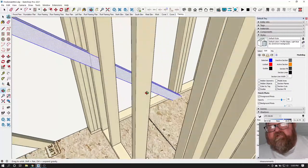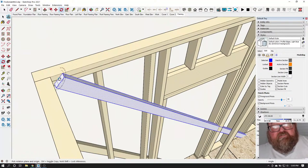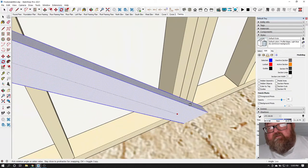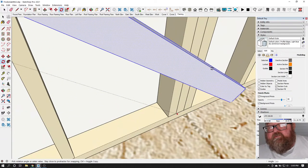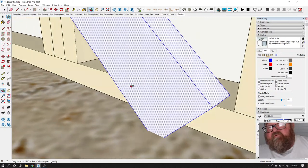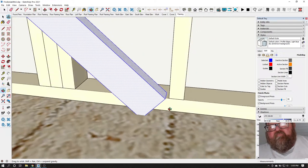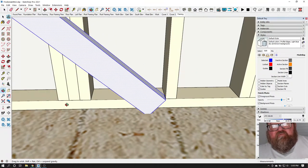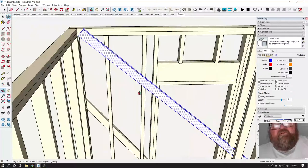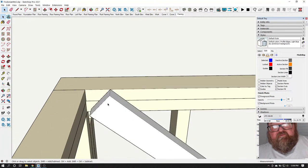You don't want to do things twice when you're building. These 2x4 braces really need to be about 12 or 16 feet long. I'm going to raise it up to where it's barely sitting on the floor, because you want to be able to put a nail into the bottom plate through here — that's where you're going to get your strength. The bottom plate is nailed down good and stable, so that's where you want to nail it, and also up at the top.